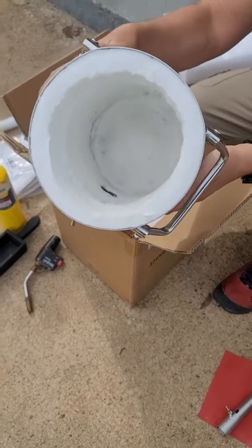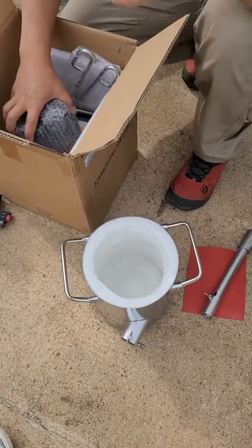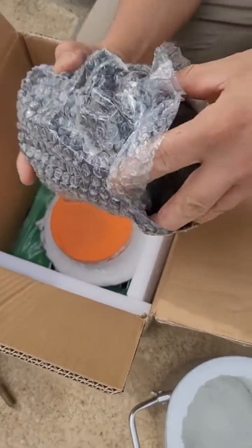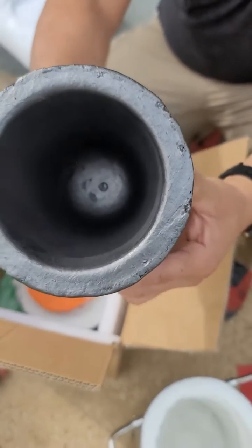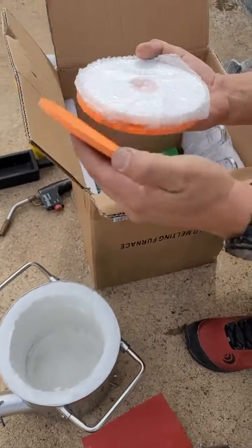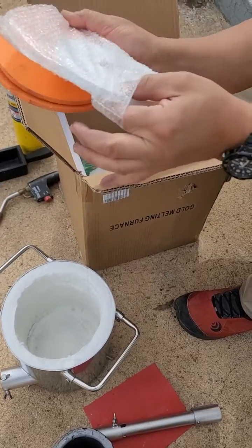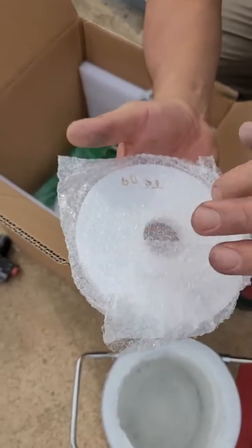Don't be fooled because this works really well after a couple of uses. This is some sort of fiberglass covering — I'm not sure what type of fireproof material it is, but it's really strong. This is a crucible that comes with the set; it's a ceramic-like material that gets red hot and contains the metal you're melting. I've worked with copper, bronze, and aluminum and it works really well. These ceramic plates — two come included — one goes inside to place the crucible on and the other outside to rest the crucible after pouring.